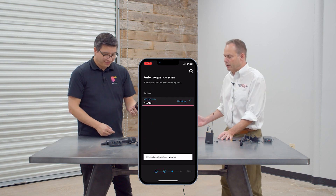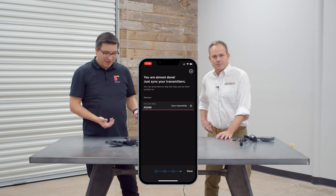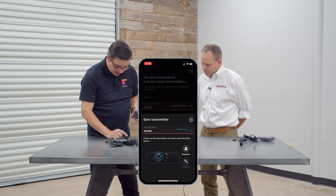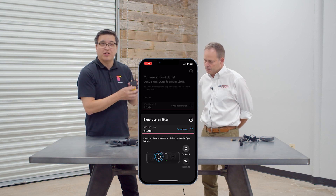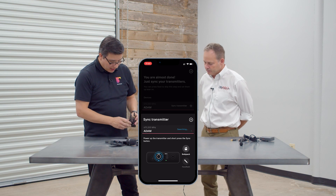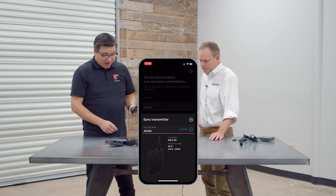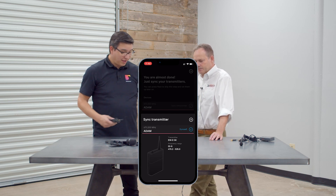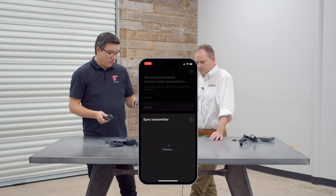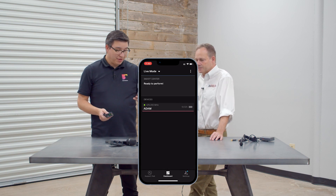Turn all your receivers on, turn off your transmitters — stay within Bluetooth range. Bluetooth Low Energy is good for about 120 feet away, so you don't have to be right up on the unit. Now we want to sync a microphone up to the system. We'll hit 'sync transmitter' — I've got a body pack here. It's telling me to turn on the microphone, so I'll open the flap and hit the power button. The app gives you instructions on what to do. Hit the sync button, and now we have our body pack synced up. It's got my name on it, so I know this is my lavalier. Hit done — we're ready to perform.